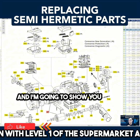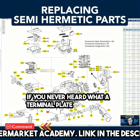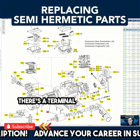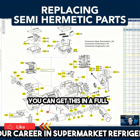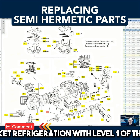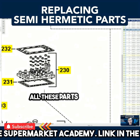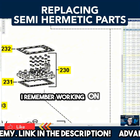This is the terminal plate assembly. If you've never heard of a terminal plate assembly, that is the plate that has all the electrical pins on it, as you can see right here. There's a terminal plate gasket, a terminal plate, and a terminal box. You can get this as a full plate assembly pre-made, or you can buy all the parts individually — nuts, washers, terminal insulators — all of these parts are replaceable.